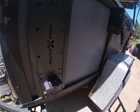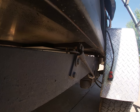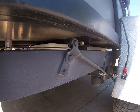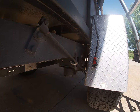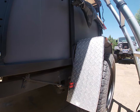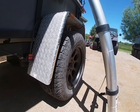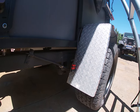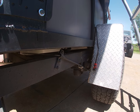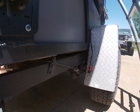Continuing with the frame, you can see the three-inch channel again. I'm using an axle-less suspension system — a 2,200-pound rated system. I did that on purpose because I wanted hubs with a 5-on-5 bolt pattern just like my tow vehicle, but unfortunately they didn't have those for the higher-rated setup. If I had it to do over again, I would put on the 3,500-pound system for a little extra capacity, because with the way I built this trailer I'm operating right at the limit.